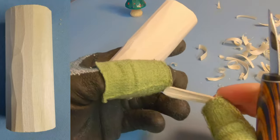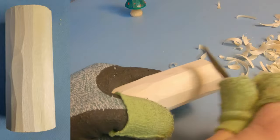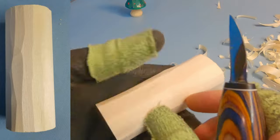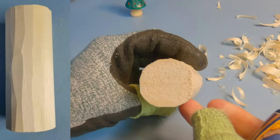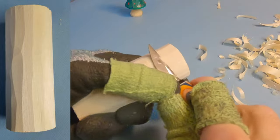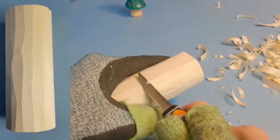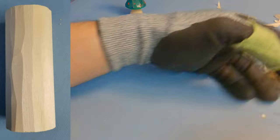You don't have to take off large chunks of wood if you don't want to. Sometimes it's just easier to strip off thin layers at a time and work your way down. For the most part it is rounded out — you can see it's more round on each side. If you find some points where it's a little bit more rigid, just round it off. At this stage it is not important for it to be completely round just yet.